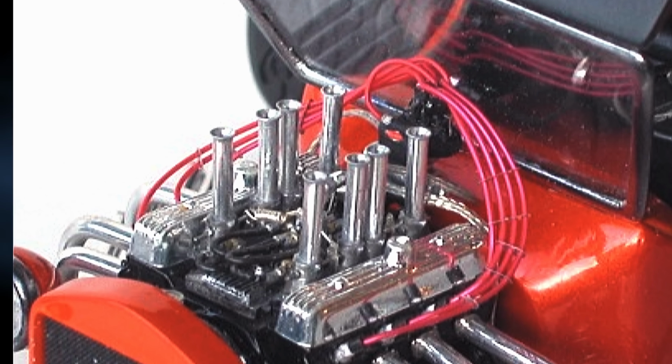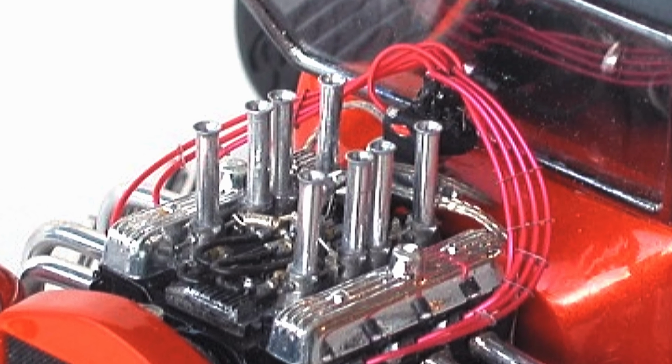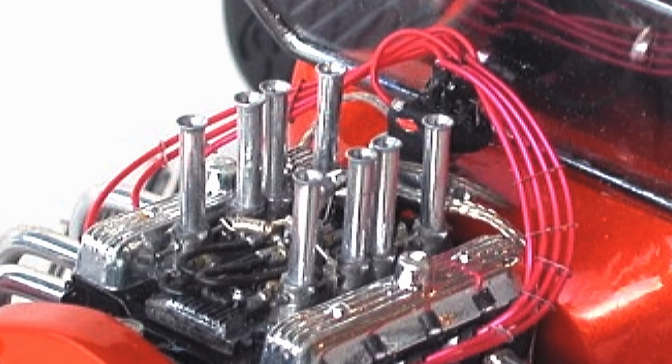And then lately I've been putting it in a lathe chuck because I know it can hold it more evenly on 3 sides or 4 sides, and compressing that with whatever tool I can find on the tailstock, and just turning it by hand. But that's a really tough thing no matter how you do it, because you're trying to flare 8 parts and have them all look identical. Yeah, I can see I have one that's a little wider than the rest now that you said that. It is hard, so you got to make more than one.